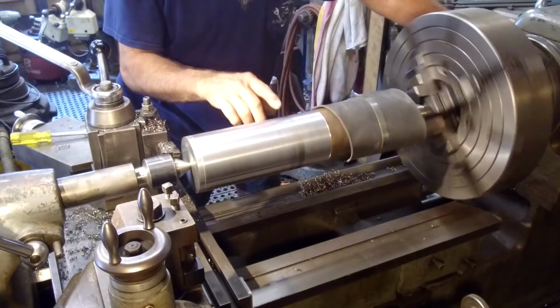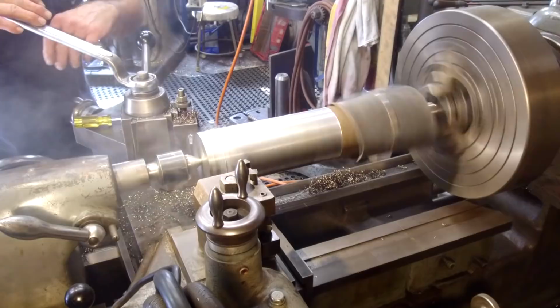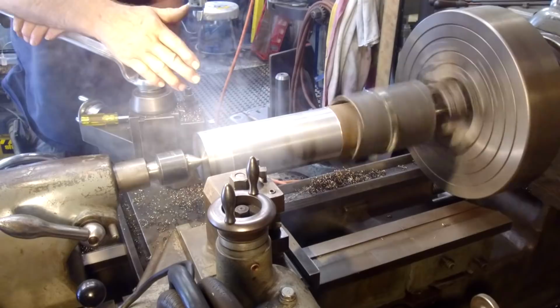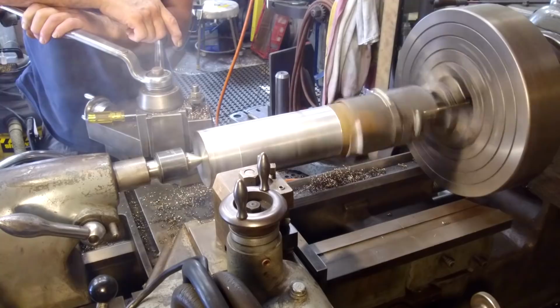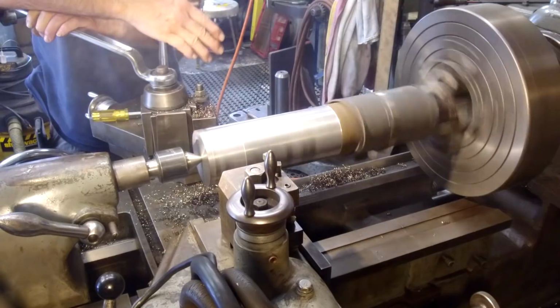We're also going to look at how that cut looks pretty good there. Okay, turning a pretty good chip over here. They're heavy. I shortened up the tailstock. Moved my compound over here, shortened up the tailstock. I'm still doing the 450. I'm still feeding along a little less on the feed rate. But I'm able to get underneath there, and I got a baby butt surface right here. And I think I'm going to be happy with that. We'll be able to duplicate that finish. So sometimes you've got to work at getting through your mishaps along the way.